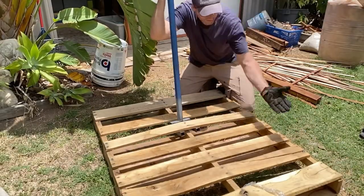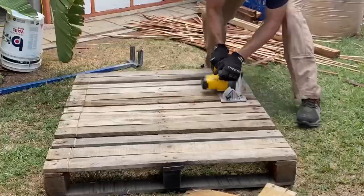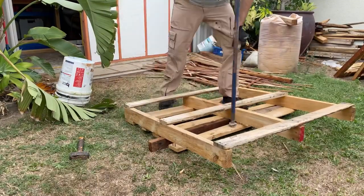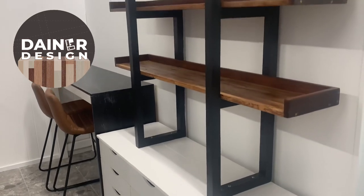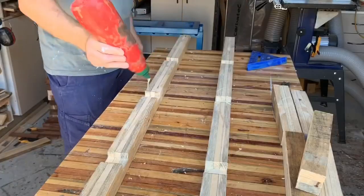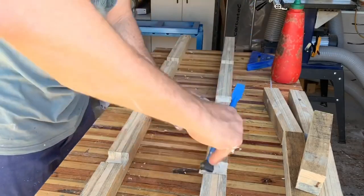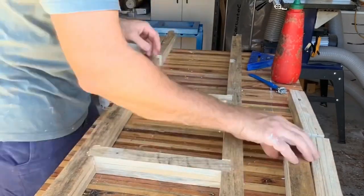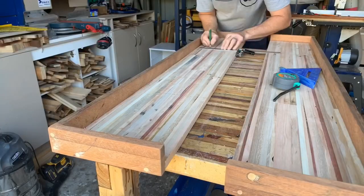Kudos to you — two minutes to go. I do have a full video on all my tips and tricks for how I pull pallets apart and how I make life easier so you can get stuck into the build. I've countersunk the backside of the shelf supports, and I'm going to glue and screw all of the cross beams into their rebates to form a ladder — one of those fancy Japanese-style joints.